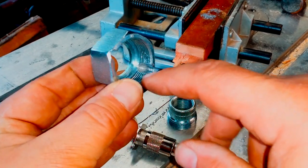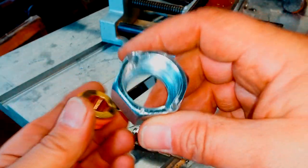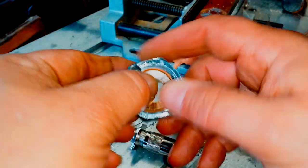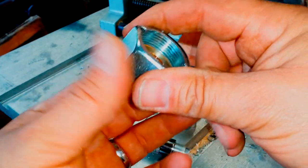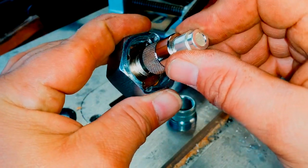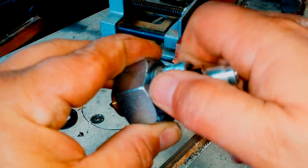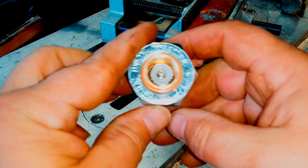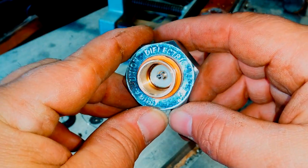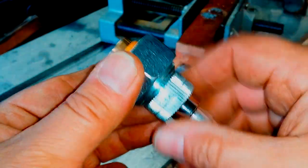After finagling, filing, and fitting — with those grooves there — what I'm going to do is put the dielectric brass piece back in again. So you have the insulator, the brass piece goes in first, next you have your connector that fits right between there and there, and then your back nut slides over the top. So now you've got your connector — you can see the inside is not touching the inside of the brass — and that's your connector for the base.